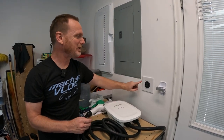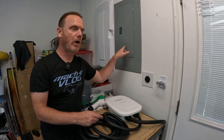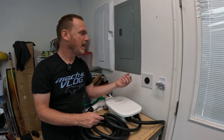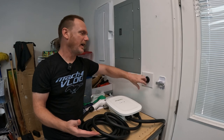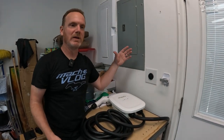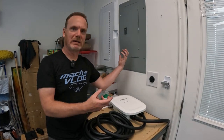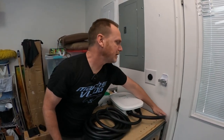Our friend also reminded us why we prefer plugging in versus hardwiring. You can get a little bit more power if you hardwire directly into the panel — I'd recommend an electrician for that — but the other reason to use a plug is flexibility for troubleshooting. If the car isn't charging, it could be the car or the charger. If it's plugged in, I can unplug this charger, use the Ford charger that came with the Mach-E, plug that in, and if it works then I know the issue is with the charger. If it still doesn't work, it's either the car or the circuit panel. So we're just going to plug it in and go through the setup process as if it's on the wall.